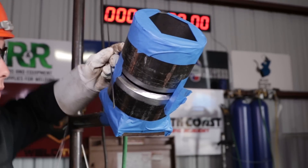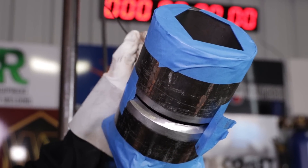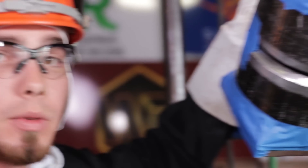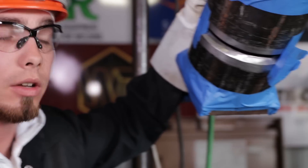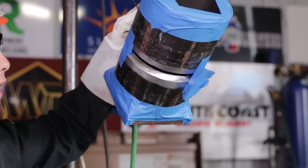We're gonna be using a one-eighth rod and we're gonna poke it through our tape up on the top. We don't want to take too much tape off of the sides because we want to keep as much purge inside as we can. We just want the purge coming straight out at the bevel right on our weld. This is a very dirty rod — we want to keep it as clean as we can in there.